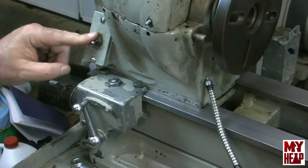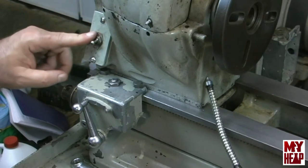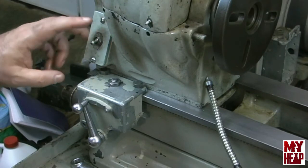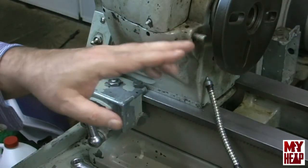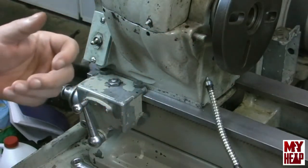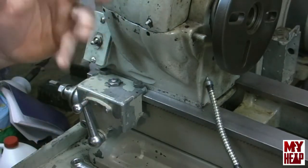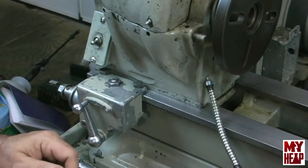This lathe did not come with a reversing drum to reverse the headstock. Probably the reason is that these are threaded — the headstock spindle is threaded — and reversing it with a heavy chuck on there could cause it to unwind and come off and injure yourself or damage the lathe.